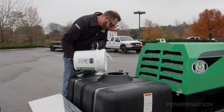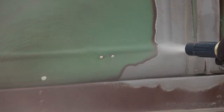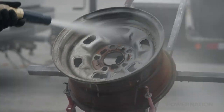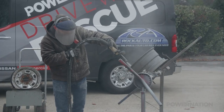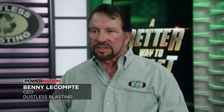You've seen the Power Nation team use Dustless Blasting equipment on all kinds of parts and pieces, and for good reason — it's quick, effective, and portable. In addition, it leaves behind very little blasting media. The media is suspended in water, which means there's no cloud of dry, drifting dust when blasting. What we're doing essentially is throwing wet handfuls of sand, and we only use five gallons over a 15-minute period.